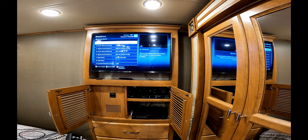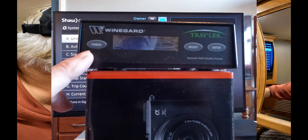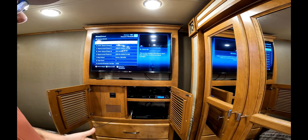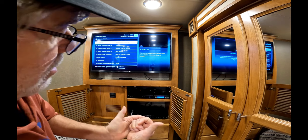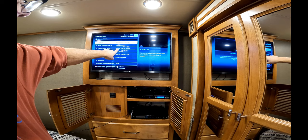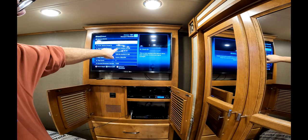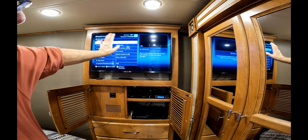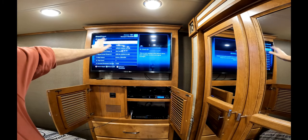If you don't stop it, it will go back into search mode and just keep looking. This is how you manually stop it so you can watch your channels in the interim. Turn on the Power button on the Winegard controller box, power it up, and then be ready with your fingers to hit the Power and the Select button on the controller the moment that line C - Signal Level Tuner One - shows a signal on whatever channel you normally watch, such as 212, 213, CBC, BCTV.